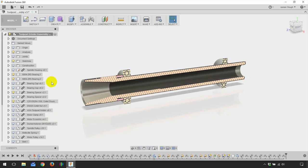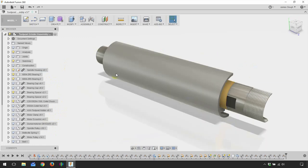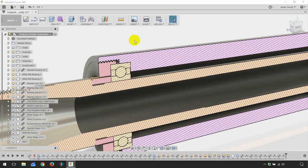The first part we're probably going to make is the spindle housing — just an inch and a half diameter piece of mild steel, turned to about an inch and a half and then bored out with registers to hold the bearings. To hold the bearings in, there are threaded caps that fit over each end: the bearing goes in, the cap threads over it locking the outer race to the spindle body while leaving the inside race free to turn. The seals won't rub on anything — only the inner race turns. There's about half a millimeter of clearance between the spacer and the lock ring, which should be plenty to spin freely while reducing the risk of contamination. Long term, I could make new spacers with flanges to create a labyrinth seal.